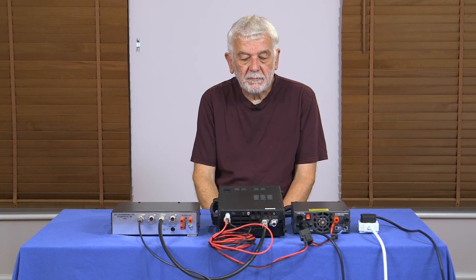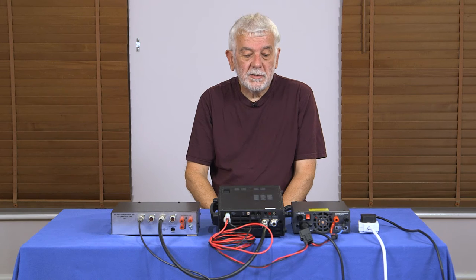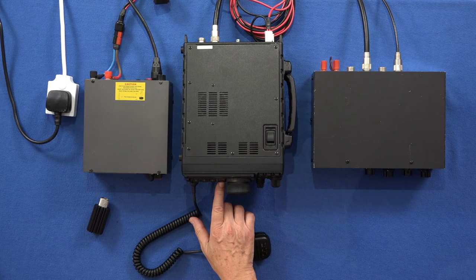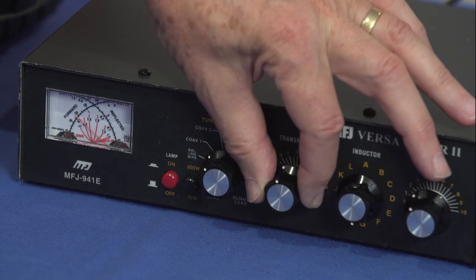What I'm going to do now is match the transceiver to the antenna more precisely. To do this, I have to change mode from lower sideband to AM. I'm now in AM mode. I'm also going to check that the transmitter power is at its lowest setting — yes, five watts. What I do now is cover the microphone, press the push-to-talk button, and adjust the controls on the AMU so that I get zero deflection on the right-hand needle showing reflected power. And there we are — zero deflection. I now change the mode back to LSB.